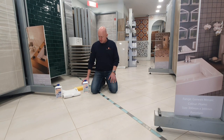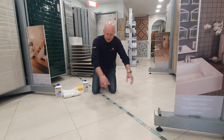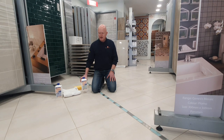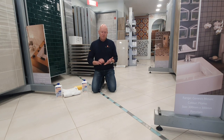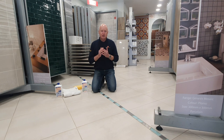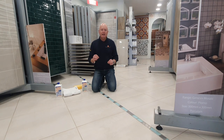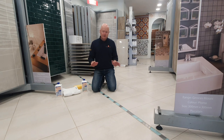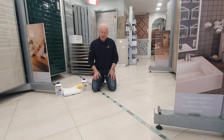The most important thing is to do a test first. We're going to do a section here where we protect both the tile and the grout. A lot of modern grouts are stain resistant and anti-mold, but they are cement-based so they can still absorb material. The protective impregnator basically stops that, and it also helps with cleaning — when you clean the floor, water will sit on top rather than soaking into the grout.